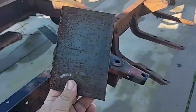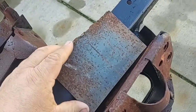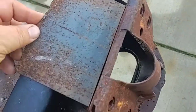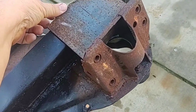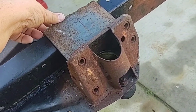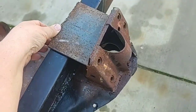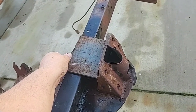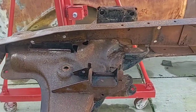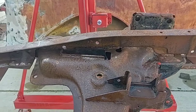So I throw all this steel on there. With this quarter-inch plate I make a trapezoid and put that on here — it gets welded to the frame and welded to the back of the tower. It sure as hell isn't bending, moving, or flexing by the time I'm done with it. I feed some wires through it, and then I box in the back of the frame to the crossmember — that's what I do for the Diplomat.